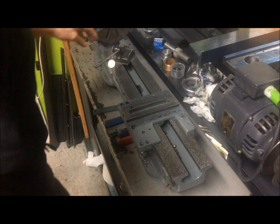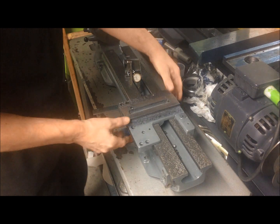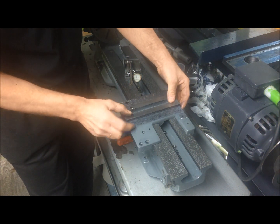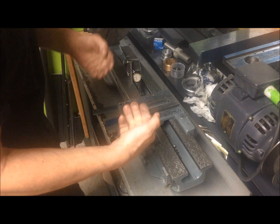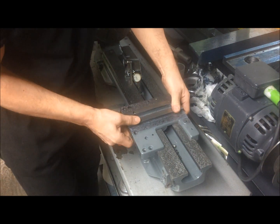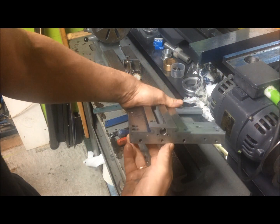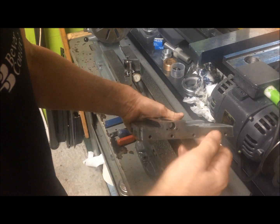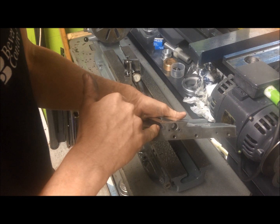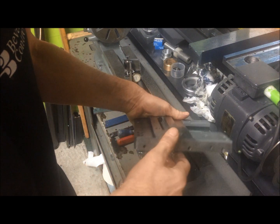See? And then the test would be, from at least what I did, to prove that these two are of equal height and flat, all from the outer sides to the inner here, so that they aren't sloping. I mean, if you view it like this, there is a tendency to scrape harder on the outer sides, half a hundredths higher here. So it actually goes up. There's a tendency to do that, so you need to think about this and scrape harder towards the inner side.